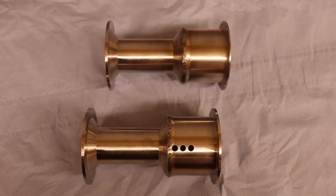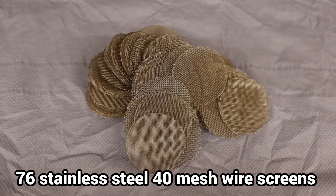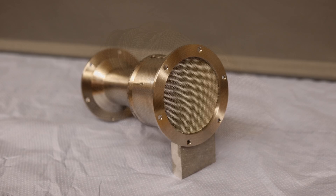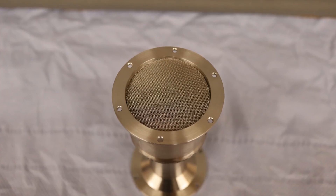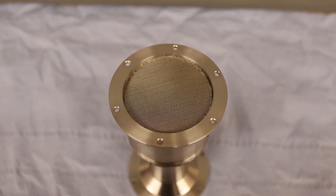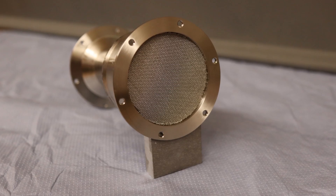Once the gas channels had been produced, the thermal buffer tubes could be welded to the heaters. The regenerator is made of 76 stainless steel wire screens of 40 mesh with a diameter of 60 mm and is the heart of the thermo-acoustic Stirling engine. The regenerator is where the Stirling thermo-acoustic cycle takes place. The travelling wave phase condition is only met here, and the rest of the engine is acoustically a standing wave.